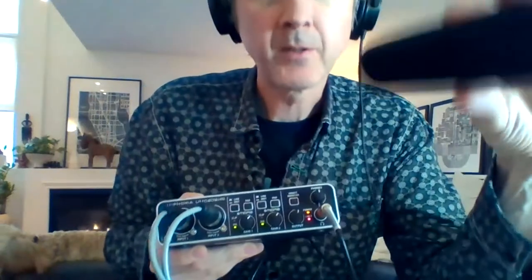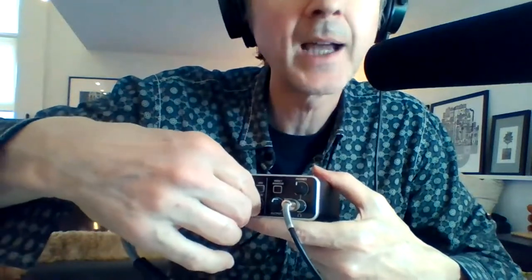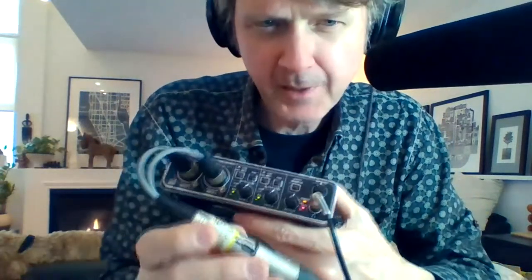For excellent sound quality — any mic will work for this. I'm using a Behringer and a shotgun microphone, a long shotgun mic I bought back in the nineties. I don't need the foam pop filter unless I'm talking really close, because it stops the pops. I split the signal left and right because if I record in stereo, I have the option of turning one channel down — a main channel and a backup channel. You don't need the splitter, but you do need an XLR cable — a three-pin XLR cable.